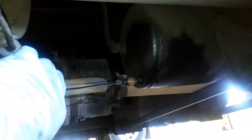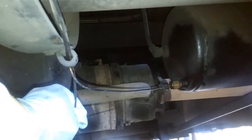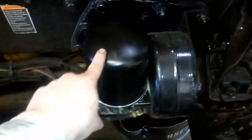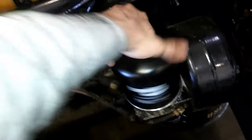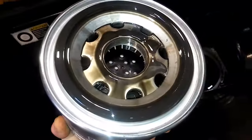After your air compressor work, you're going to want to drain your air tanks, especially if you've had one that's been pushing oil for a while. This customer noticed his air dryer cartridges were filling up a lot quicker with oil, so he had us change the air compressor. If he had let the air dryer saturate and kept driving, the tanks would have filled with oil. Make sure you dump the air out of your system before you remove the cartridge, or else it's going to fly off under air pressure. And what do you know — tons of oil in there. We're going to change this cartridge as well.